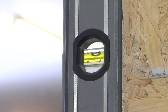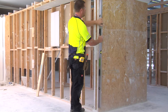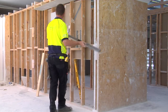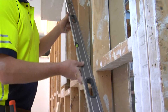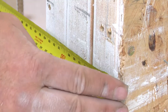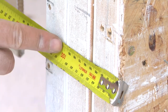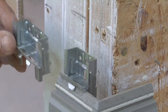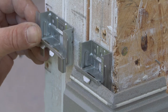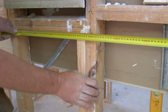The first step is to prepare the frame, ensuring to make it square and plumb before affixing any product. This may require packing some studs to create a uniform fixing plane. For external corners where you plan to use the preformed corners, you will need to ensure there is at least a 90mm surface on each face of the corner to allow room for fixing the corner clips as well as the standard horizontal panel clip. Double studs will be required wherever columns of wall panels are joined.